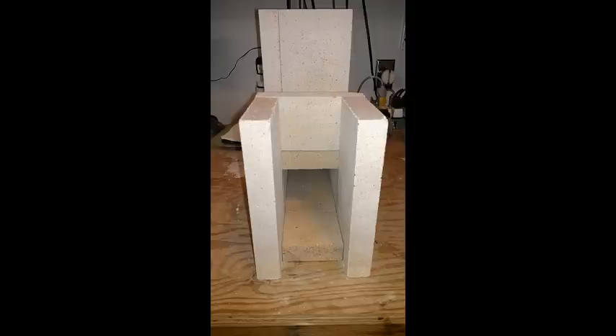That gives you a cross-sectional surface area of eleven and three-eighths square inches, which is approximately seven percent smaller than the cross-sectional area of the vertical flue stack going up. I'm trying to build this rocket stove conforming to most of the known criteria that seem to work best, and we'll see how well it goes.